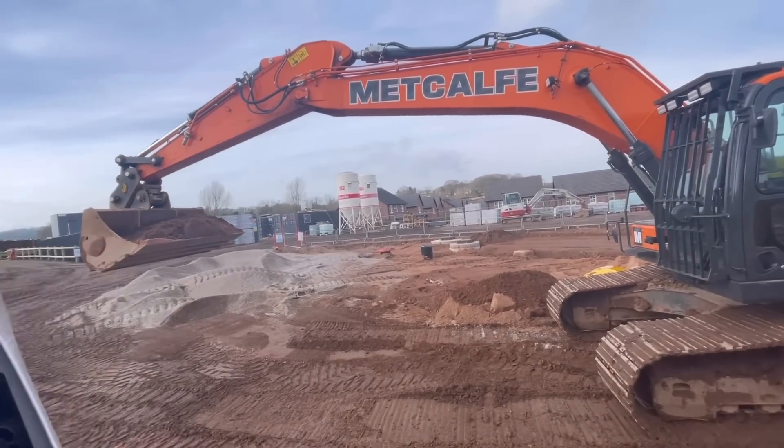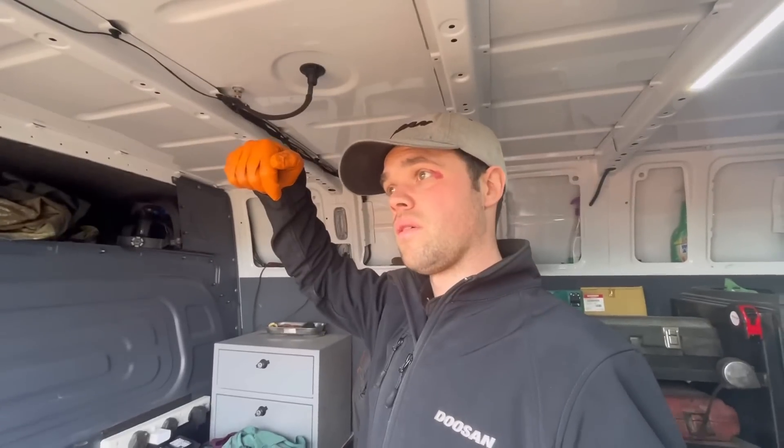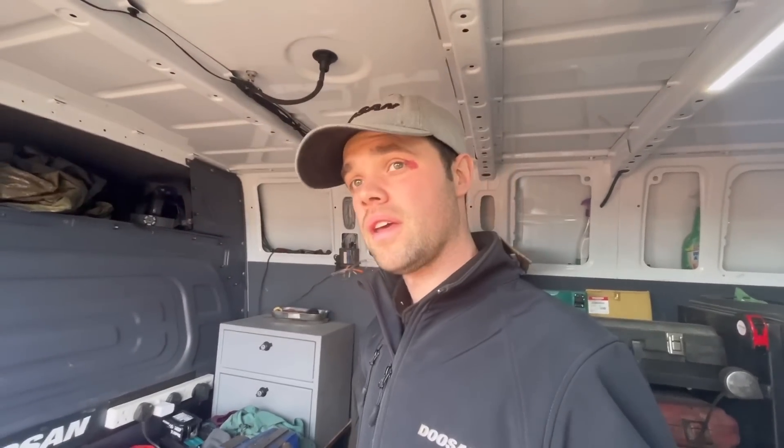Well, that's not really moved has it. Watching that time lapse back, you do see a slight bit of creepage but that's within tolerance — probably the bucket just ever so slowly curling. If you look at the top of the picture where the hammer lines are, you don't see more and more of the hammer lines, so I'm convinced it's that lock valve again. I'll get one ordered up this afternoon — we should have it in tomorrow, although we'll probably have to do it on Friday. I'll put those pipes back on and get on to the next one.